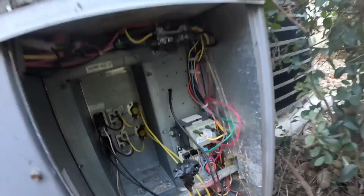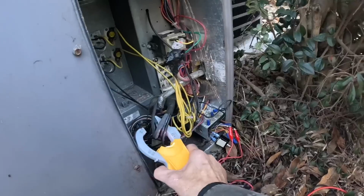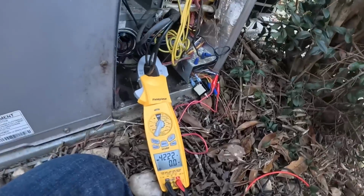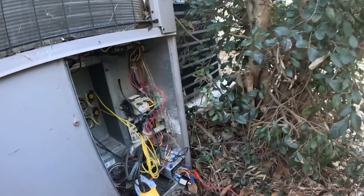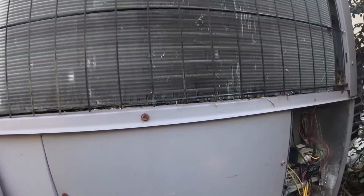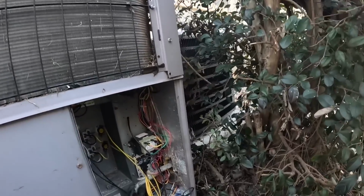Well, when I jumped to white, it smoked up. It sure did. See if I can't draw on that. 32 amps. I just burn off the dust on their heat strips. Yeah, I saw smoke come out of here. All right, contactor just pulled in.